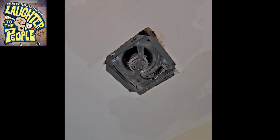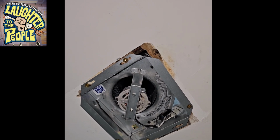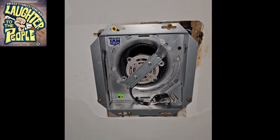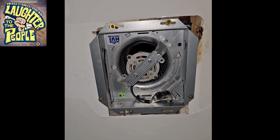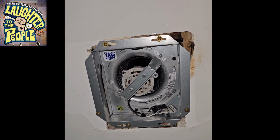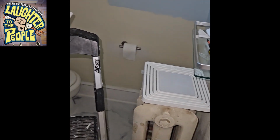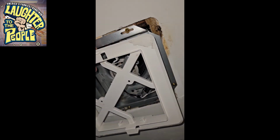Okay, here we are back down inside the bathroom, and as you can see, the fan housing is already installed and screwed up into the ceiling with some extra supports up above the lath and plaster. Unfortunately, I lost the footage that shows me connecting a 4-inch flex hose from the roof vent to the new fan housing. I also connected the electric according to the manufacturer's specifications, and now we're gonna put up the trim pieces and plug in the light, and we'll be all finished and ready to ventilate.